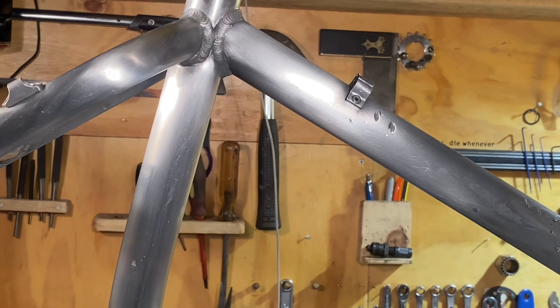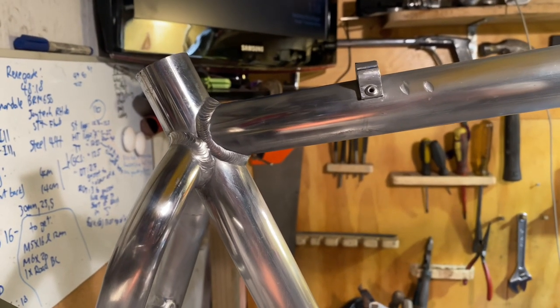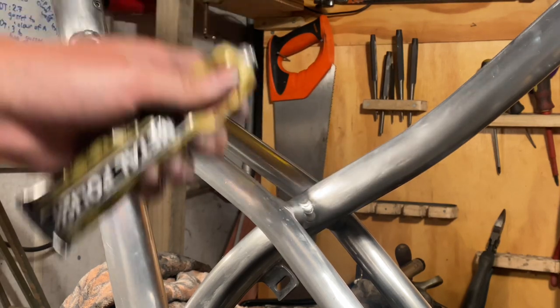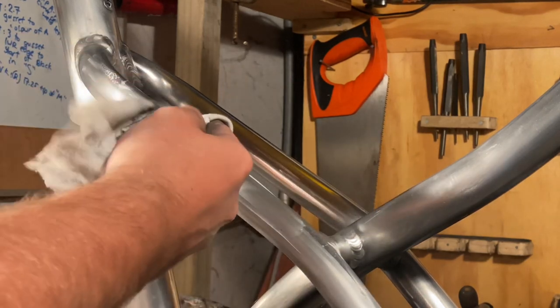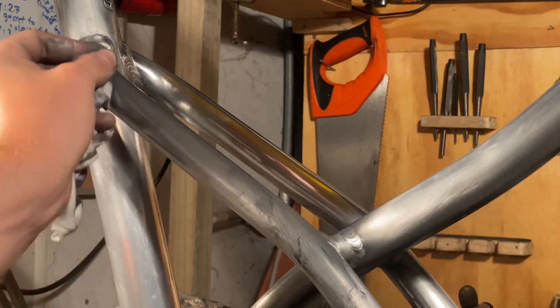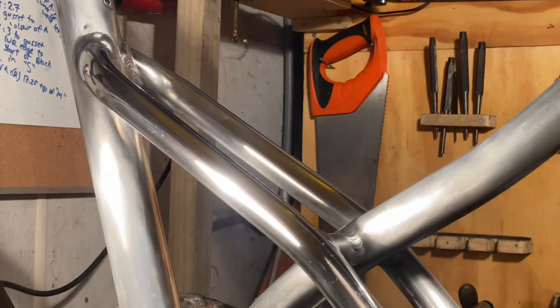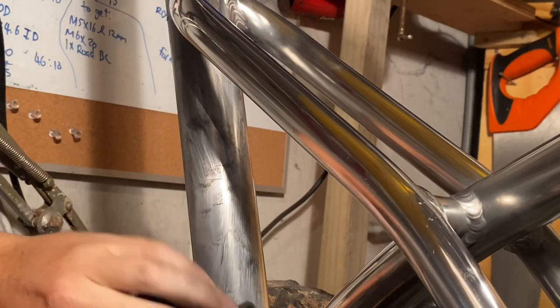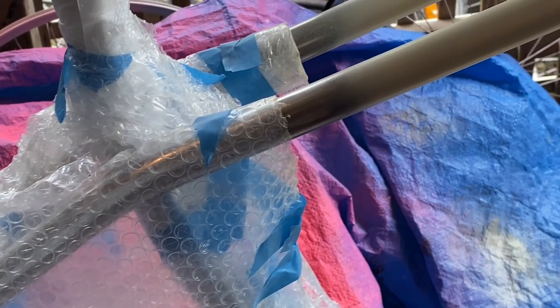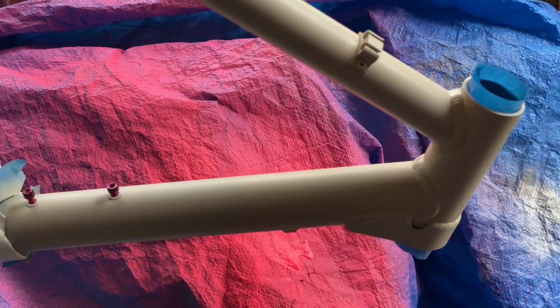Before I get to the finest sandpaper, I normally do a test pass midway through polishing - this time I did this junction here. It just gives me reassurance that I'm on the right path and didn't mess up anywhere. After the finest sandpaper, I use Autosol - it's basically just a rub-on rub-off polishing compound. This is where you see a really big improvement - it's a big jump from sanding to Autosol, it'll look really good. From there I use Brasso, a more liquid compound that gets out the finer scratches. I use a finer rag as well, and then seal it up with wax. You can clear coat it, but I prefer to just wax it and repolish as necessary.